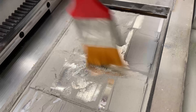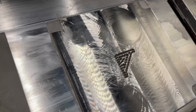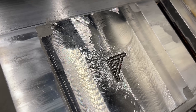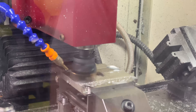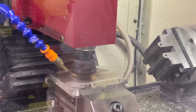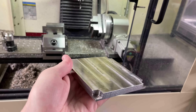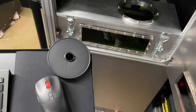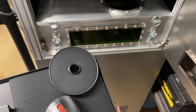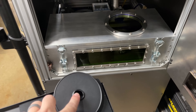Take five is a failure. I tried raising the laser power up to 500 watts to see if I could get the first layer to attach, and it seems like it's just bubbling up higher than it should be. After several layers the silicone tube got stuck on there and pulled out, so the powder is all messed up. That test actually bonded really well to the build plate — because I had too much laser power. I have to take out the build plate and resurface it before we can move on. There was also soot on the lens from burning the lens cap, and that was probably affecting everything.